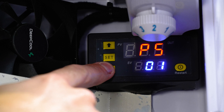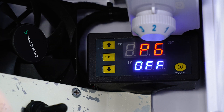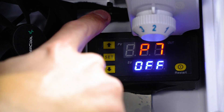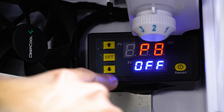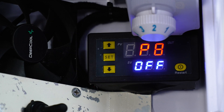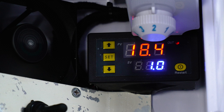I don't really have any need to delay the start, so I'll turn my delay back down to zero. P6 is an alarm or a lock. P7 is a way of supposedly locking the temperature so people can't get in and tamper with it — however, I found even when I toggle that on, it doesn't seem to work for me. And finally, P8 is a way of factory resetting this to its default settings if you've messed around in the settings and want to get it back to factory defaults — you basically just toggle that off to on, leave it for about five seconds, and it's going to reset.